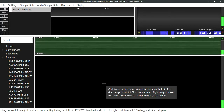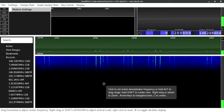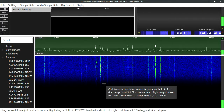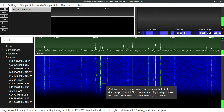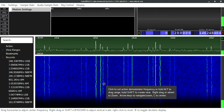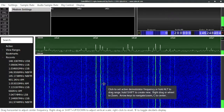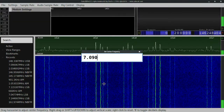Eventually, once it realises it's not actually receiving much, there's a bit of noise here. You can see the serial bytes being stuffed over the wire in the middle. Now this is the serial noise. I put a balun on my sound card, but that didn't seem to help much. Now, what frequency is that tuned to? 146 megahertz, that's not going to work.